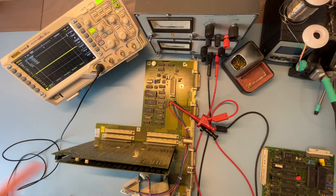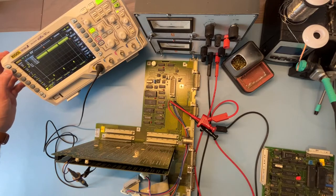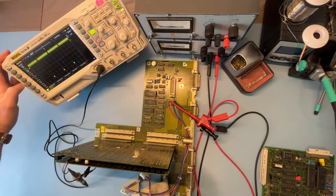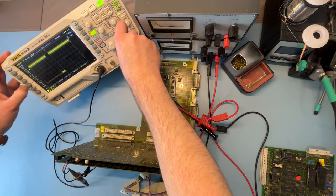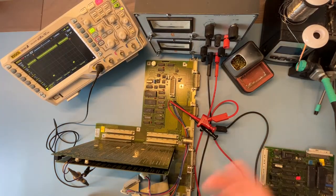Let's hook that up. I'll show you the PAL signal and what else I've been trying out. The video connector is over here — the outer two are ground and the middle is the actual signal. That very much looks like PAL: it's a 15.7 kHz signal, and if I zoom out the frame period is about 20 milliseconds, so 50 Hz — that matches PAL. With no actual data on there, it makes sense that there's not much visible on the CRT.